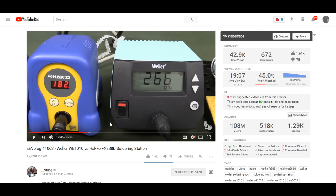Just to correct Dave Jones there — Fahrenheit is not garbage. It is superior because you get more steps within the usable temperature range. But look at the amount of time this thing takes to get to 266°F. This is awful. Just imagine this recovering as you're working on anything with a real ground plane.